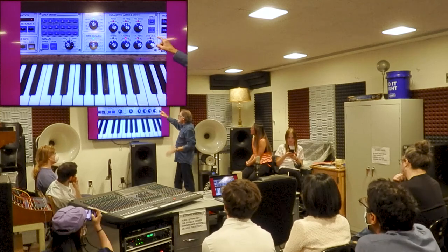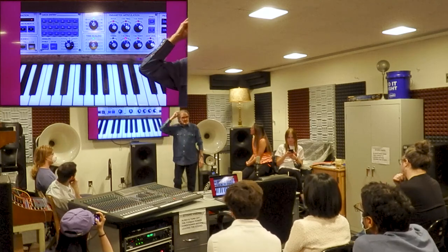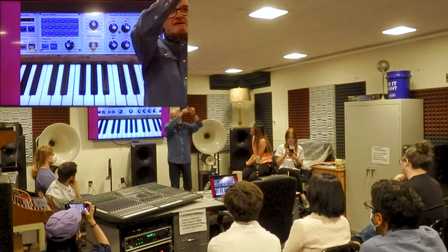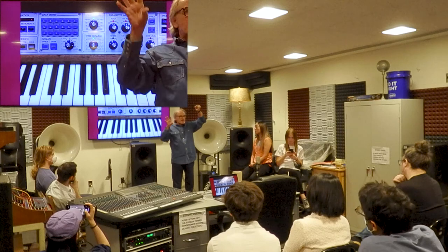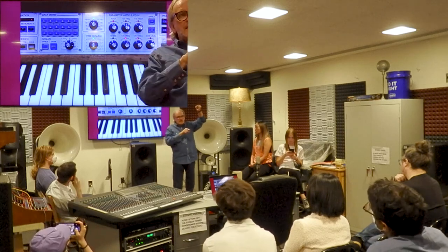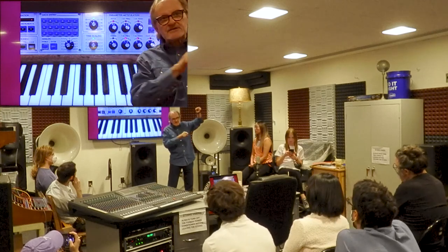And then what we call timbre. Now, timbre is, I'll show you a little more graphically later, but it is the size of a window into a wave-shaping table. So let's say, think of an axis like that, and it's memory, okay? And a waveform of some kind is generating the memory address lookup numbers. So in this case, most of the time it was a sine wave, okay?